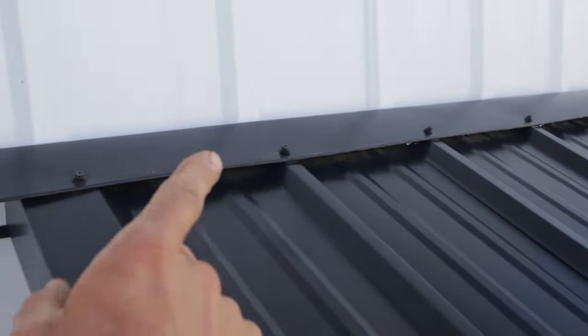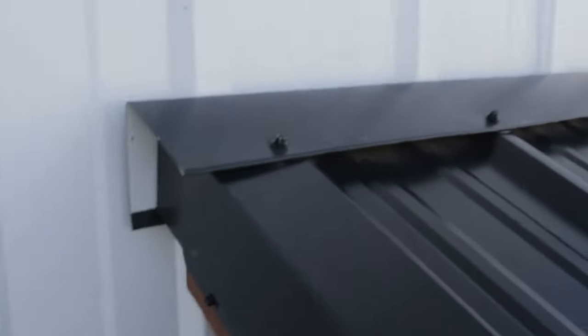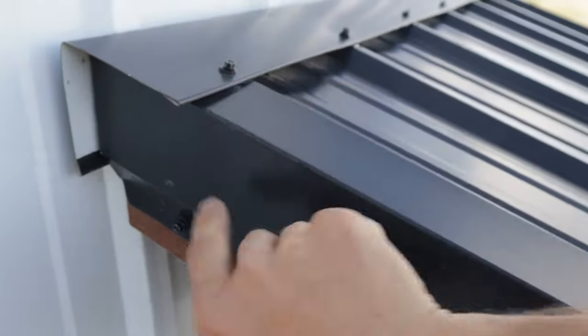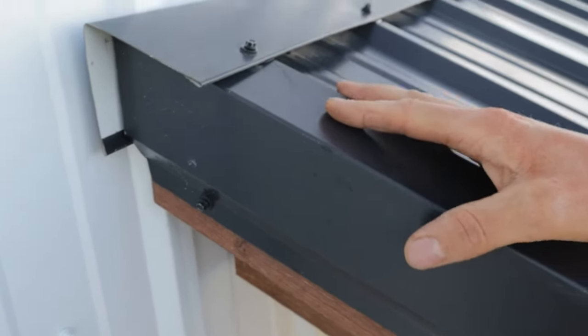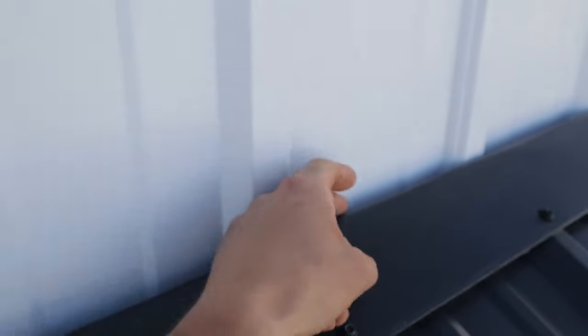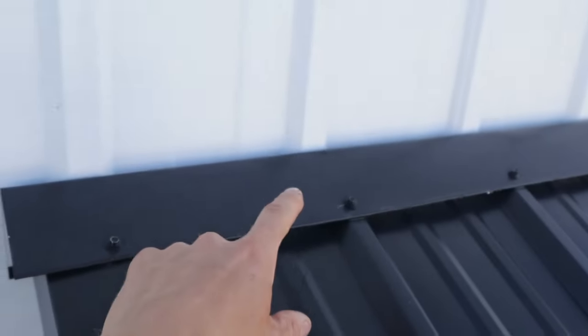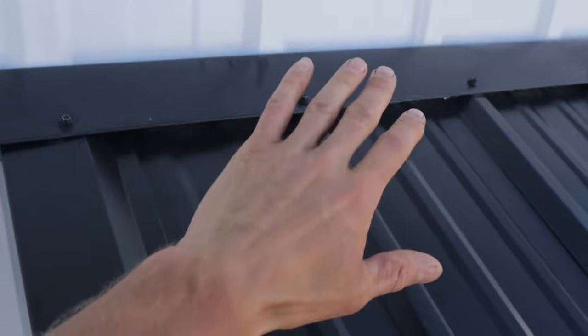Up here, where if you were doing wood siding I would have put a flashing up in the wall — but I didn't build this on site, I built it on the ground and then mounted it. So I wanted to seal this unit as much as I can. I got a corner piece, like an outside corner, and wrapped the back of the ledger and up here on the unit itself before I mounted it. If water runs down behind it, it hits the window flash and runs out. Where it hits the unit, I siliconed in these ribs where the lags went and put silicone around each pre-drilled hole — that keeps all the moisture from going into the house.